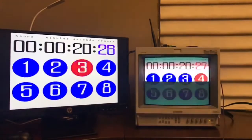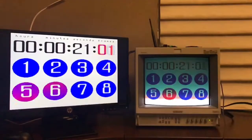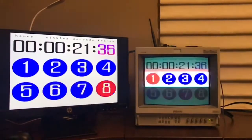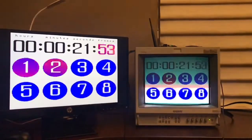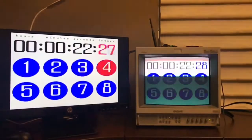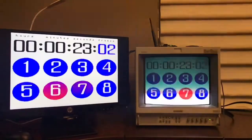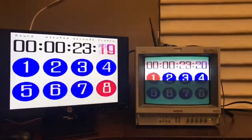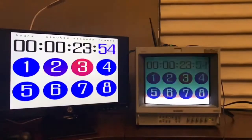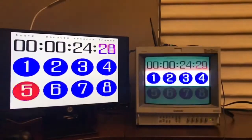The line doubler doesn't have any frame memory. It can only double from the previous few lines. I still need to hunt down a good VGA CRT to really verify that. I have a nice Apple 21-inch CRT, but it's really fickle with the timing signals. Doesn't want to sync to most sources. That's a bummer. But once I find a real VGA CRT, I'll verify that for you. But overall, this is looking pretty promising. Half a frame of lag is pretty good going to an LCD.